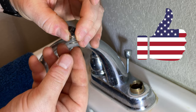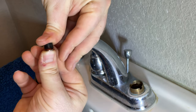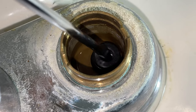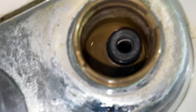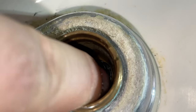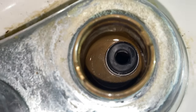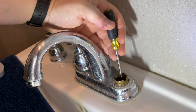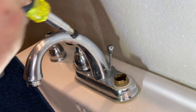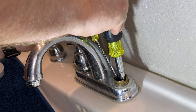The name of the game when it comes to faucets is getting a tight fit between the rubber seat and the cartridge, and that's done with this little spring action. Now drop in your spring, and if it's got one side that's wider than the other, put the wide side on the bottom. Make sure this gets seated properly — just press down on it until you feel it springing back a little bit. You could also drop the spring in the hole with a screwdriver and use another screwdriver that fits just snugly over the seat. This isn't really necessary for this one, but for some showers and other applications it really helps when it wants to fall out.